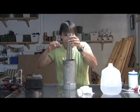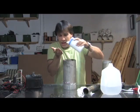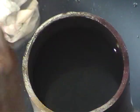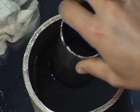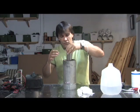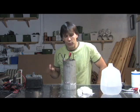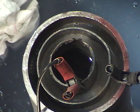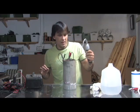I'm going to pull this out and add a little bit of salt. What the salt does is make it more conductive, so you'll see the amps it pulls go up quite a bit. I'm going to add just a touch — about a tablespoon — mix it around to get it nice and mixed up, then drop this back in. The neutral plate increases the surface area and makes it more efficient. Right now this is running at 3 amps — at 12 volts, 3 amps equates to 36 watts, which is about the equivalent of two compact fluorescent bulbs.